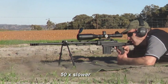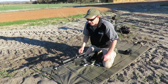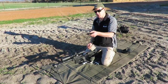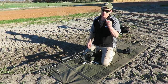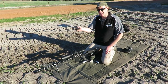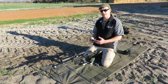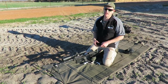Anyway, that's probably going a step too far. My real point was to show the difference between an even muzzle brake — where you've got even blast top and bottom — and how straight back the action is on an otherwise well set up rifle. With an uneven muzzle brake, it can actually cause the opposite. People can get confused — a rifle that's jumping up in the air, this sort of brake works really well and is really helping. On a hunting set up rifle with the classic stock that hasn't got a straight centre line, this is a nice balance. There is a little negative — you're stealing from Peter to pay Paul — making the front of the muzzle push down to stop the back of the rifle lifting the muzzle up. So you're getting a bit more flex and harmonics, but as a basic set up it still works really nicely.